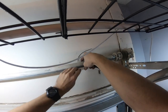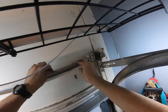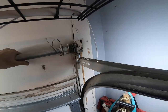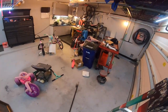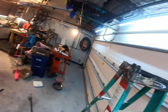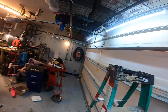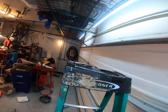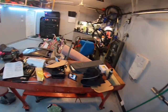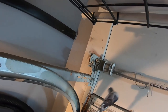Don't over-tighten by too many turns - don't go over three or four extra turns beyond what the instructions say. If it says 16, don't do 21 turns because it will break the spring. I know this because I only had one spring broken initially, and I actually added more tension trying to figure out which spring was broke. I made it about three extra turns and it snapped - you could hear it in the tube.